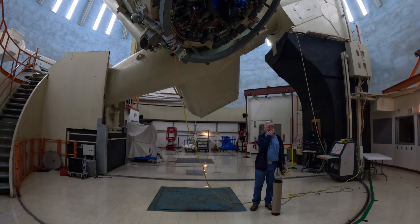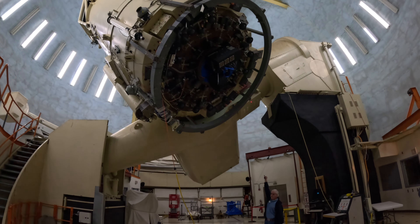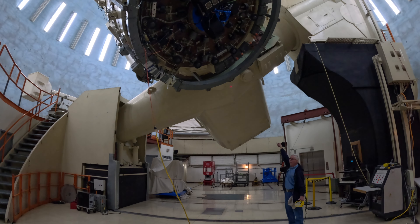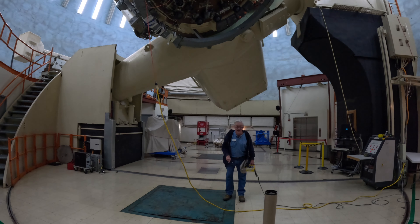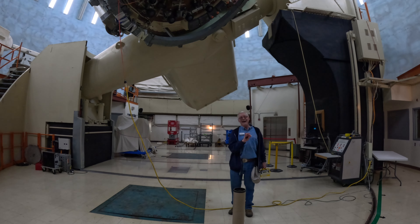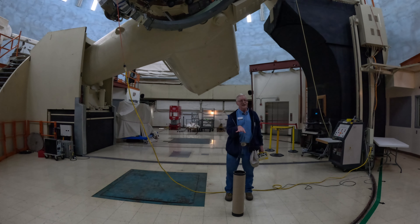It makes for a great conversation piece. I moved the telescope away so you can now see the polar axle here behind me. This axle is hollow, and it's wider at midpoint because we have a fourth mirror inside that axle. Turning that tertiary flat around and sending starlight into the polar axle, it strikes that flat mirror in there and sends light down the hollow axle shaft, through the control room where astronomers work at night, all the way down to the fourth floor where it strikes a fifth mirror, and then goes into the optical bench room we call the Coudé spectrograph. That's the instrument astronomers are using today, and it remains the highest-resolution spectrograph ever built in the world.